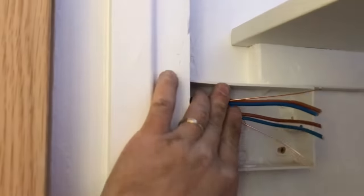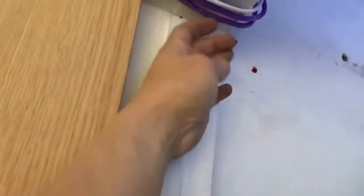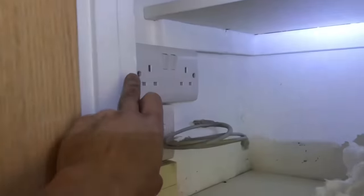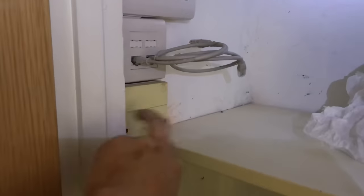Right, simple but effective — sensor and an LED light. A bit of making good for the painter, but she's got a painter handyman on this job. So that's ticked off the list. The next one I've got to do is get in this cupboard, sort out the CAT6 cables, the radial, and the BT point. Now I've got that socket second fixed — cables come in this cupboard, down the back of this frame, double socket there. That comes from the fuse board and runs around the rest of the flat as a radial. Below here I'll have the two CAT6 cables terminating into a box with two patch leads, a BT socket, and the home hub on this little shelf. I'll show you once I've finished it. There we go — double socket, two data cables that patch into the home hub, and the master BT socket. Next little job is fitting a fan isolator for the bathroom fan. Nice little fan isolator done.